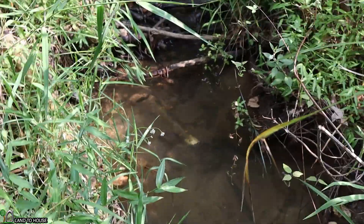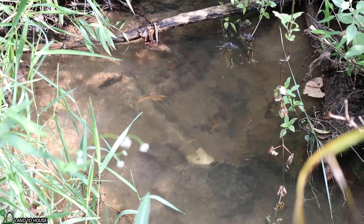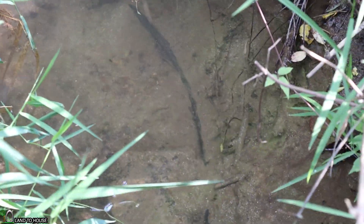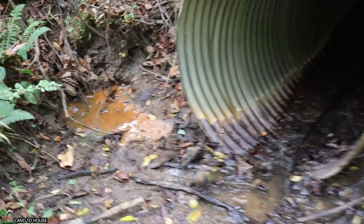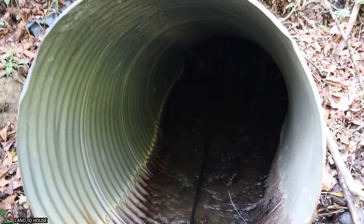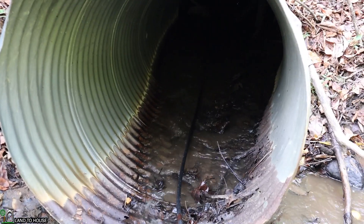This small pool of water is the intake for the ram pump. If I zoom in, you can see there is a PVC pipe with holes in it covered with window screen, held together with zip ties. That water goes down a half-inch poly pipe about 350 feet, with a drop of around five and a half to six feet total to a bucket. It was quite a nightmare traveling through that 75-foot culvert — I got to the last 20 feet and had to climb in. The bottom of the culvert was all rusted out, but I got it done.